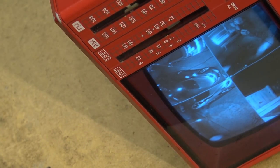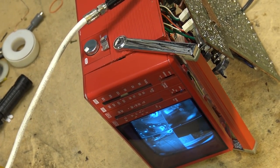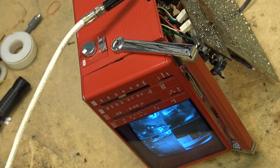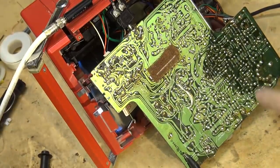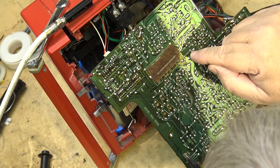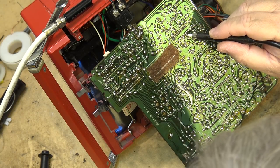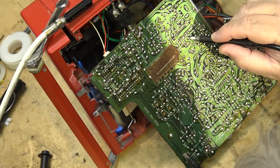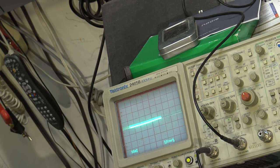So this one's pretty much done. The client may want me to put a video input on it, so we'll investigate where the video detector is on this. IC101 is going to be the IF on this unit, so video is going to be on one of these pins. It's easy to find out — we just go through here with the scope and find which one's got video. I've got video right there. If I disconnect that pin, one side will be an input and one side will be an output.